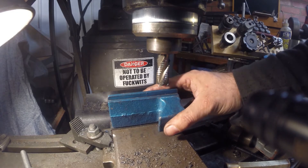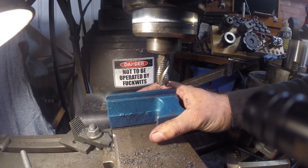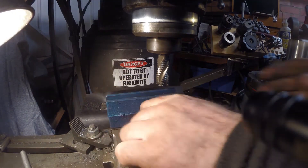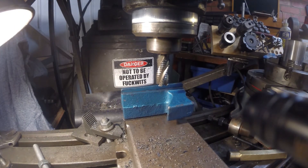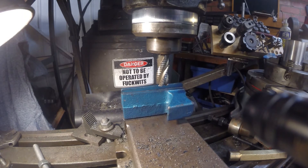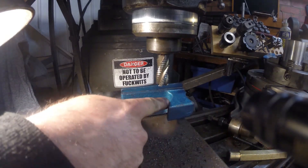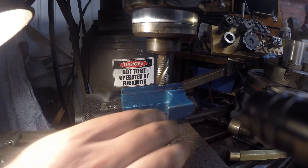What can we grab hold of? Well, that's got it pretty nice. I'm kind of happy with that. I'm really taking the tiniest little shave off, so I'm thinking if I spin the vise around and get that Y kind of true with that and take a skim across it, we're only going to be taking a little chunk.